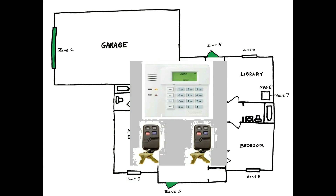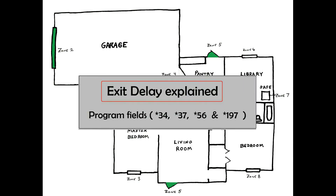To fix this problem, you have three different options. You can use key fobs to allow you to arm and disarm from outside of the house — follow the link above to see how to do this. Or you can program the VISTA using these four fields to allow you to open and close a door after you've actually armed the panel, which I'll show you how to do in this video. And finally, there's an option called Vent Zone, a much more complicated programming method that allows you to arm the system with a door or window open.